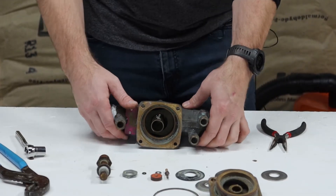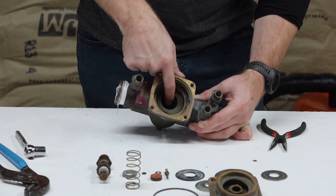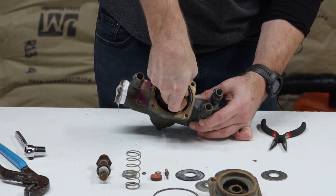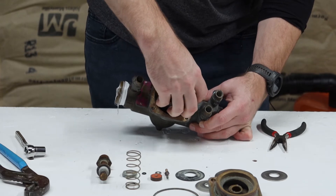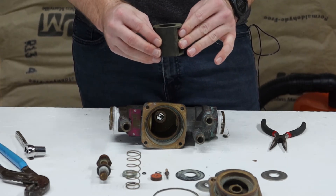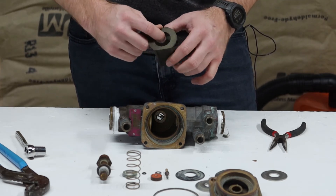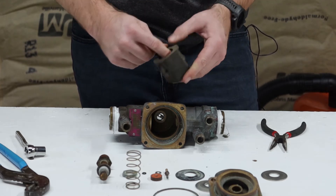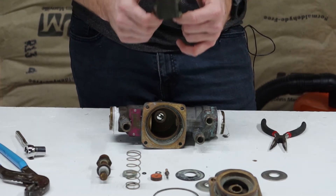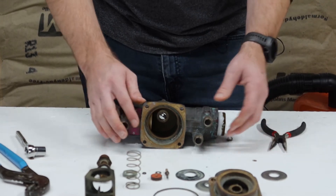Now let's get to the checks. Inside you'll have the spring — make sure you take that out too for the relief. You're going to have a retainer, and this plastic retainer is what keeps the checks from going in and out and keeps them in place, so you're going to want to pull that out. Highly recommend: if you do not have a spare one of these and you're just taking it apart to take a look, do not pull this out. It's plastic, it gets brittle, it's tight sometimes, and you'll end up breaking it and then you're out of a backflow. Make sure before you take it apart you have another one of these — I keep spares on my truck at all times.